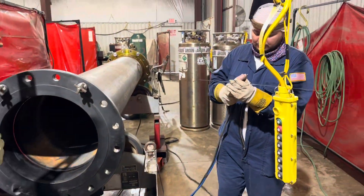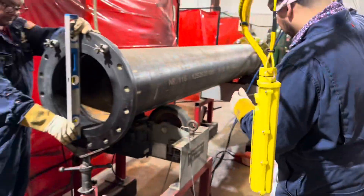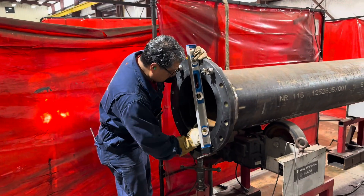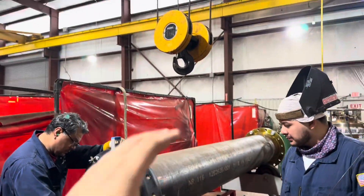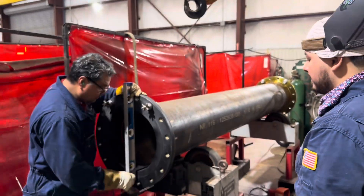He's running about 100 to 111 amps for his penetrated tacks. You want to level the flange before you tack the bottom. Most people use a jack stand to hold the flange up, and sometimes they'll use the crane if it's too heavy, just in case the tack breaks.